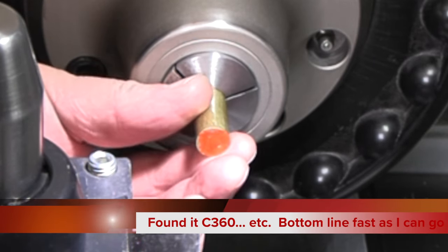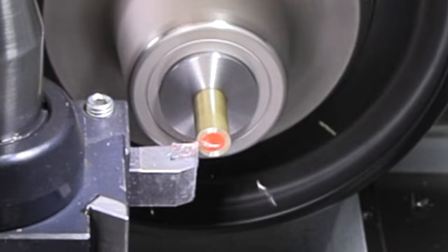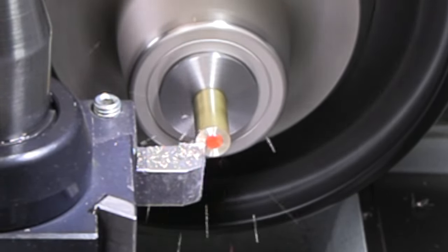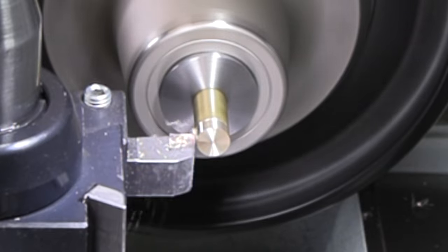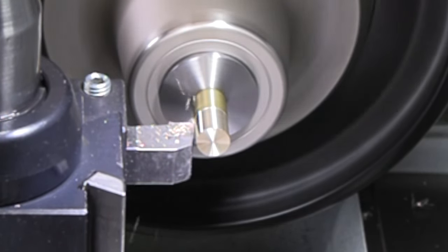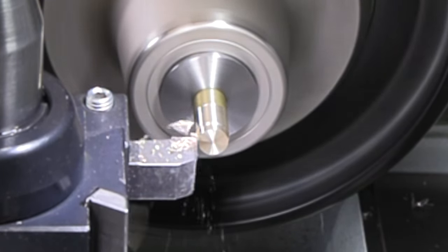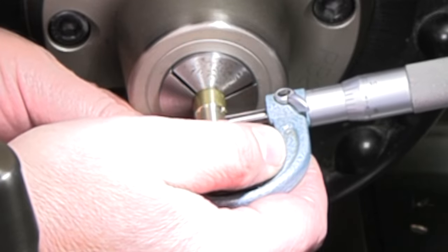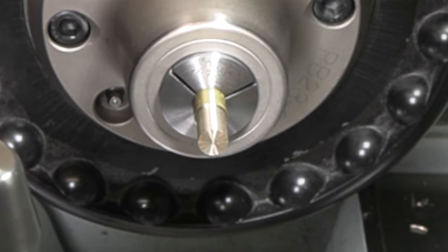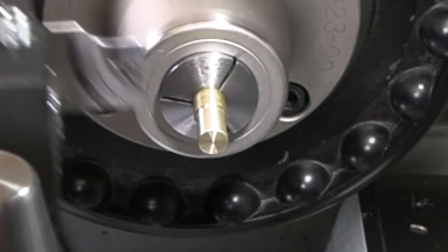All right, so brass is not actually in my machinist calculator, but that's all right. We'll run this little piece at about 1200. All right, just did a little 10 thou skim. We're at 487, going to 437. Well, 4375, so yeah, no flex in brass. That stuff cuts pretty nice. All right, let's part one off, get the other one done, and we'll get these drilled and reamed.